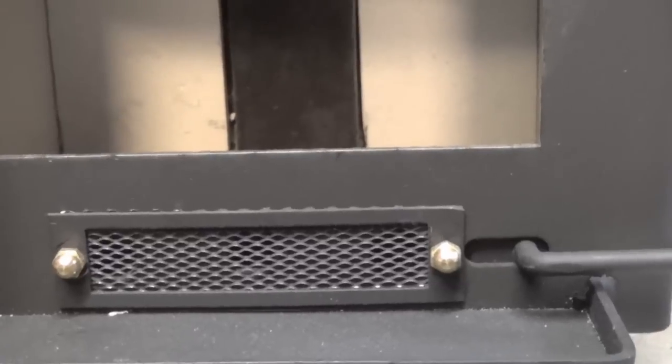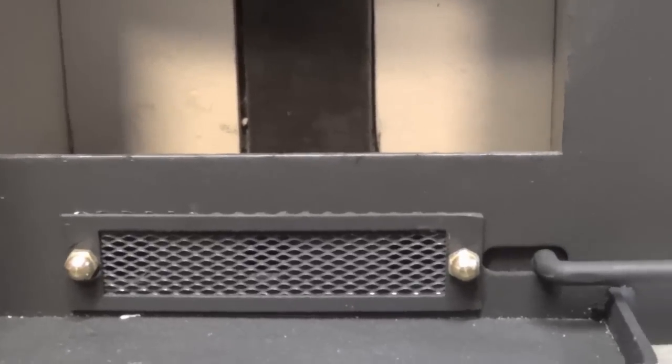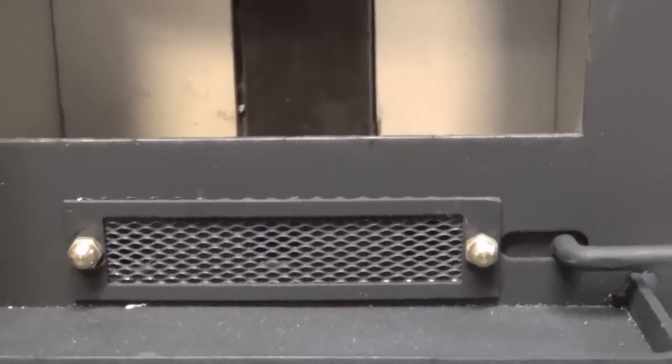This might be a little shaky because I've got to do it by hand, but down in the bottom where I showed you the air inlet in the back, that comes up into this tube right here, and that goes along the top, and you can see where the air holes vent right there for your secondary combustion. Right here in the front, we have another vent with a nice screen across the front to keep stuff from shooting out at you.